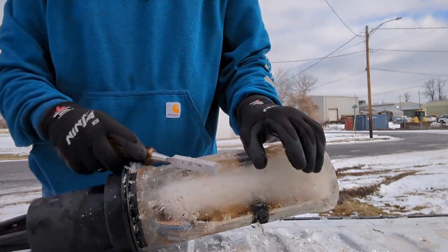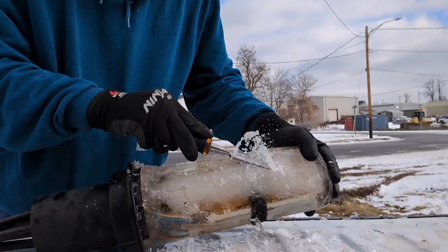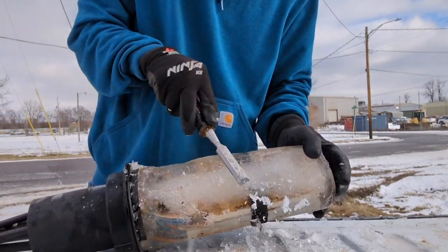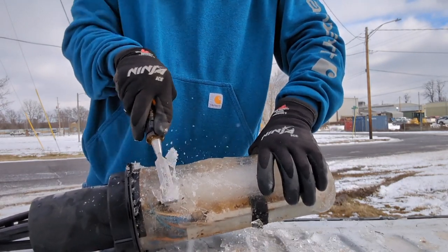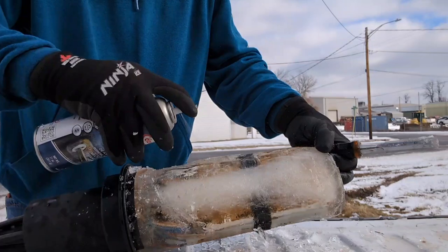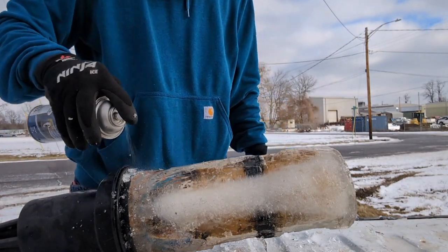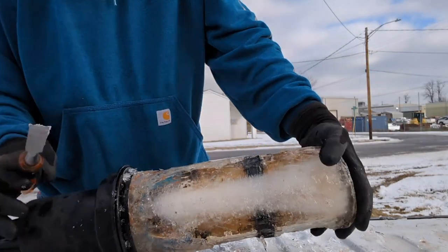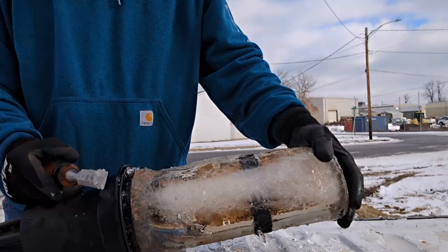So I'm trying something new this time. I'm actually using a combination of a chisel — you can slowly chip away at the ice more carefully, keeping away from your fibers, because you're not stabbing at it or hitting it, you're just kind of sliding it. And then I'm applying de-icer, which is actually breaking down the ice and making it come off smoothly, kind of like a slushy. I just wanted to show y'all what a closure outage from water getting in during a blizzard looks like.